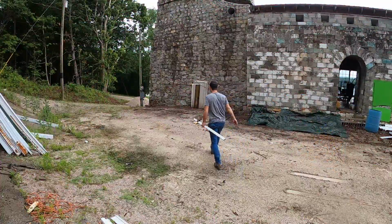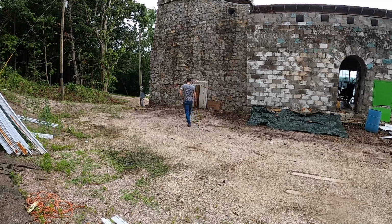We got our receiver on. Now we just gotta find that high spot. And I know this is probably, honestly, the highest spot, but what we're really worried about is the high spot where the footer's actually gonna go, as opposed to the area that's just gonna be filled. We're gonna check this corner here. I've got some fluff over here that we can hammer drill out of there, so I'm not as concerned about it being there.